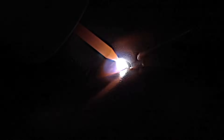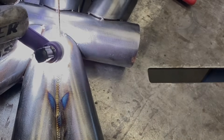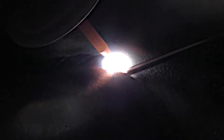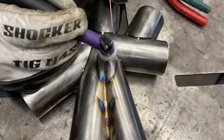Brad Goodman is doing the welding here today. He pumps the pedal a lot on things like aluminum dog boxes, but also on chromoly and stainless. Watching Brad's foot, you can see he's not using the full range of the pedal — he's not romping it all the way to the floor. He's just flowing that metal and backing off while he steps ahead, and it's one method of heat control. We're going to come over this with a second pass, but first let's take a look at the settings for the first pass.